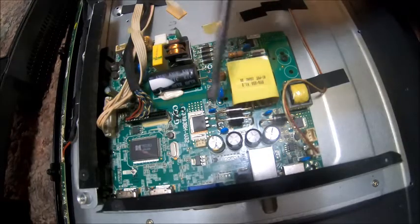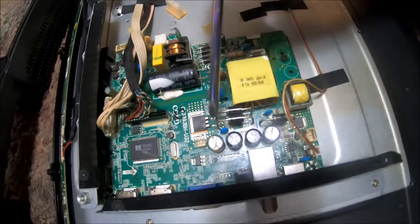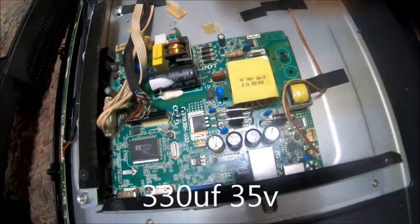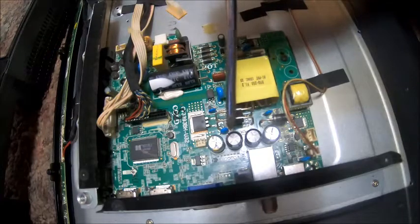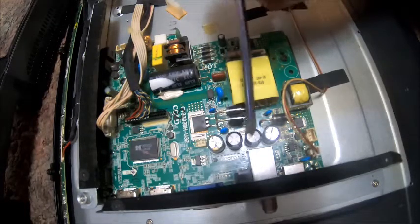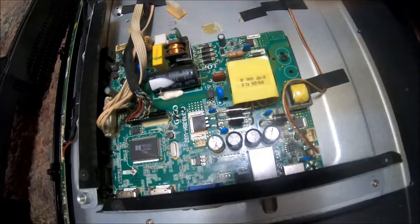So we're going to take you out to the gun room, and I've already got the soldering iron ready to go. We're going to take these two out and replace them. Now, these are 330 µF at 35 volt — both of them are. I went on eBay, and I'll put a link to these in the description. They weren't very much — you get 10 for like $6 or $7. If we can replace these and it works just fine, it was well worth the $6, and that will basically make this TV work like new again.